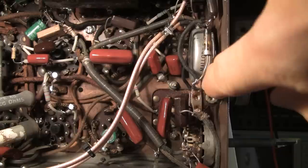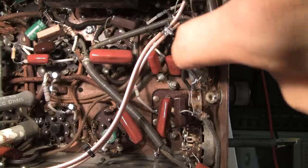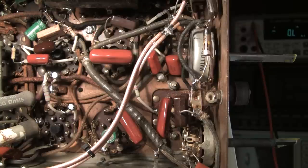I find that the connections on the backside are just a crimp fit and they stay pretty good. This potentiometer is a very special potentiometer and you don't want to swap it out unless you absolutely have to. There are five taps in total on this potentiometer dealing with the tone circuitry inside this radio. If you just sub it out with a standard three-section potentiometer, you'll really lose a lot of the tone and the way that the radio is actually supposed to operate. By putting a three-terminal potentiometer in here it really does affect the tone — you lose the bass and all that kind of stuff. So it's a pretty special control. This one restored quite nicely and works very, very well.